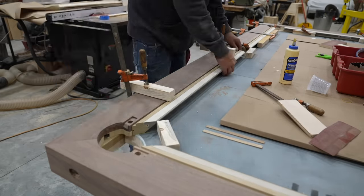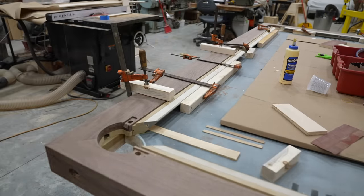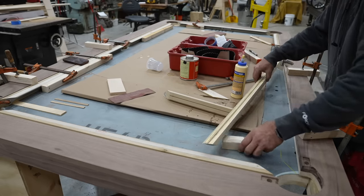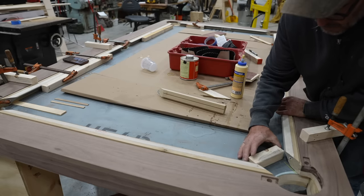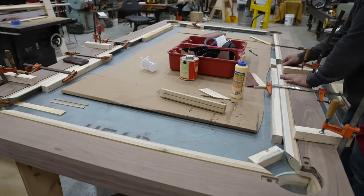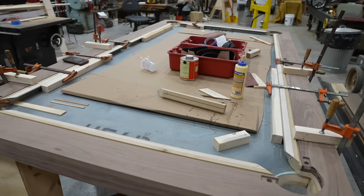You see me there holding a spacer, getting rid of the glue so when I go to put that up against it everything's nice. I didn't want the rails to be higher than the sides. Ultimately I realized the rails should have been lowered a little bit to make room for the felt, but Jeff said what I did isn't completely uncommon. Technically speaking you want the rails to be a little bit lower so that when you wrap the felt, it's at the same height as the side, not just the thickness of the felt above it.